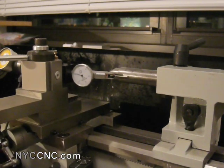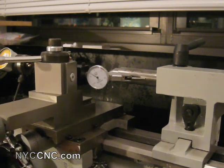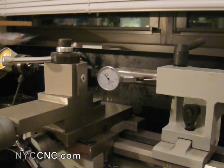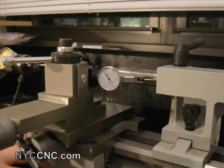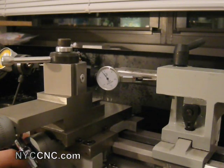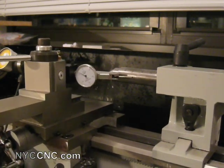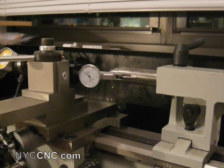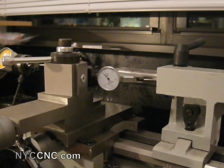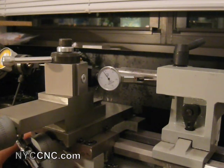As someone pointed out on the Yahoo group, your drills and Jacobs chucks and such don't necessarily hold perfectly true anyways, so don't need to worry about getting it within a few tenths yet. I'm also finding it interesting as I move the DTI back to the start — I'm two ticks off, or about a thousandth off in my favor. Running it back out to the end, I'm still at five ticks or two and a half thou. Back to the beginning, I'm at two ticks or one thou. So maybe the runout is even less than two and a half thousandths. I'm still new to this, so we'll probably just continue to take some measurements over time and see how it pans out. Thanks, everyone.